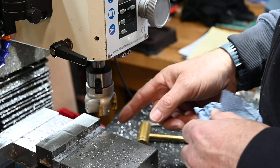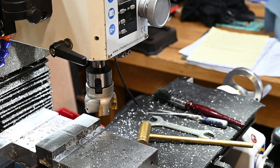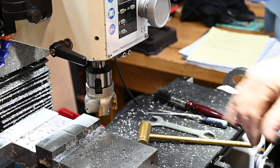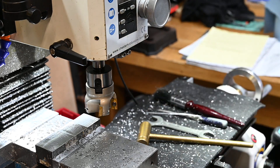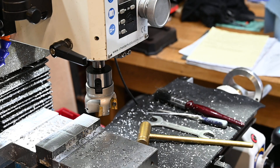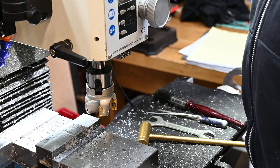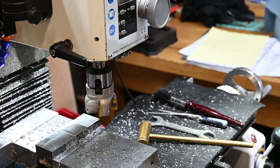What I'm going to do is run this quite deep now. I'm going to take it down and try to take a millimetre off, because carbide tips essentially run better the deeper the cut — but I don't know if the machine will be up to it to be fair. Right, this is going to be a one millimetre cut.